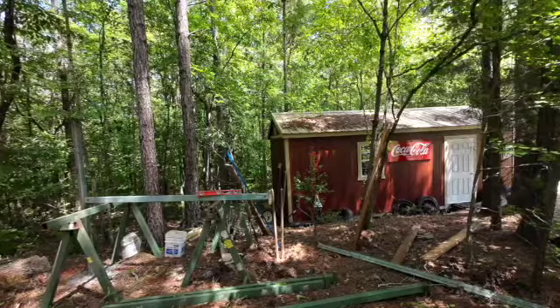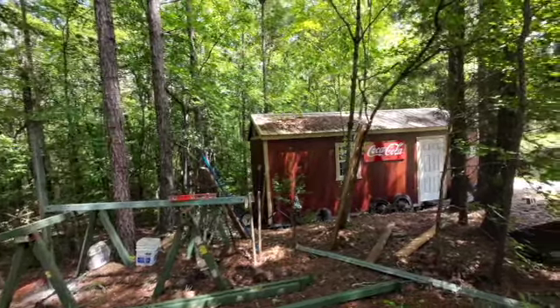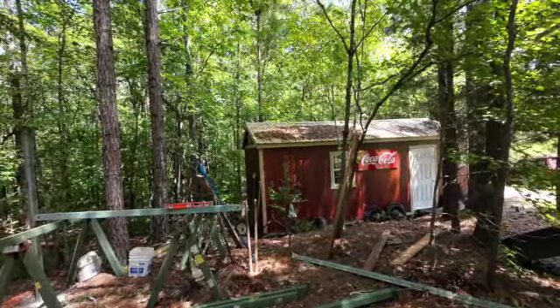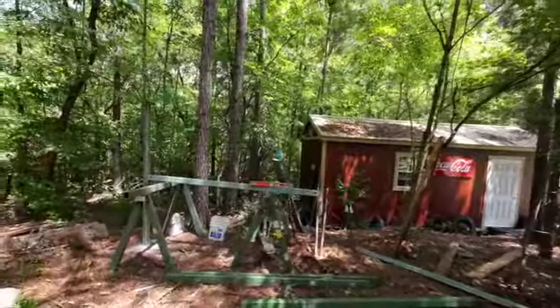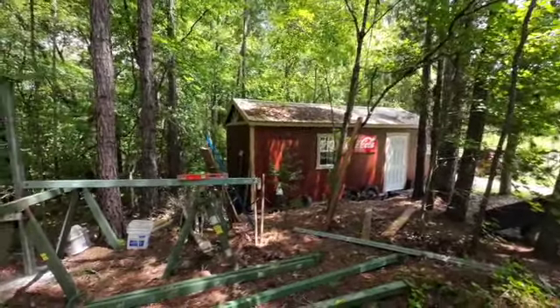I do a little work out here. If I can get that next post set, get gravel under the bottom of the post, get some cement around the base of it, I'll be happy to walk away from this for another day or two. So I'm going to run and get a grinder and drop cord and I'll come back.